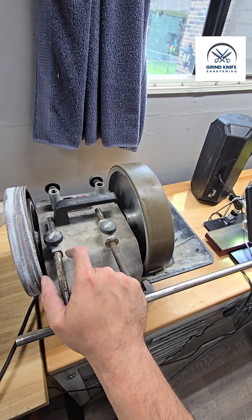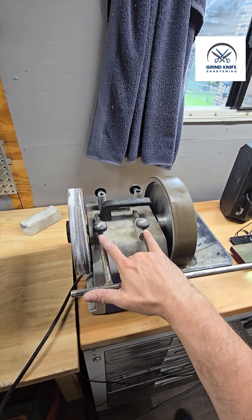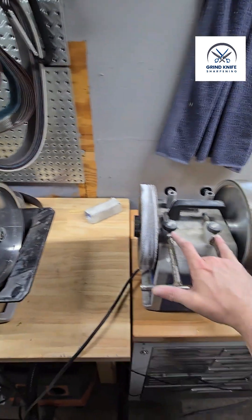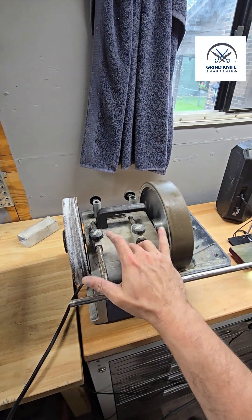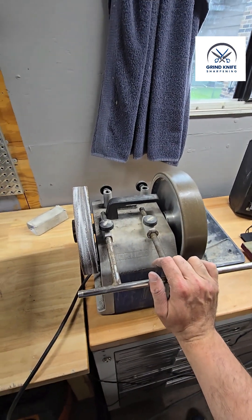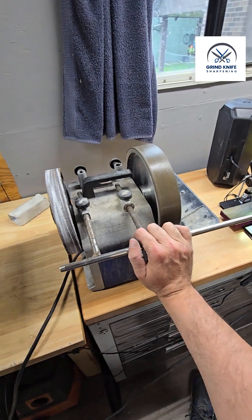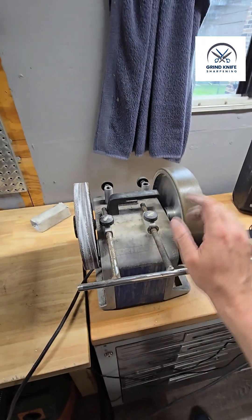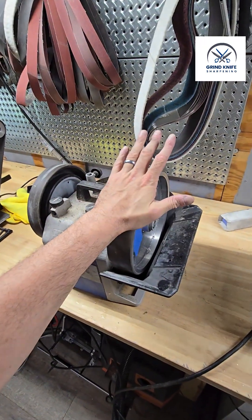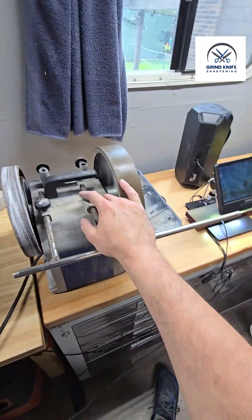Since I'm stepping down and not doing a lot of Tormek stuff anymore, I don't have a vertical frontal base anymore. With the resin bond wheels we're going to go edge trailing, because if you catch the edge of your knife going edge leading into the corners it's not a lot of fun — not necessarily detrimental, but these wheels are fairly expensive and you don't want to shorten the life prematurely. The edge trailing method tends to be pretty fast anyway because the feather burr you get off this wheel is easily removed.